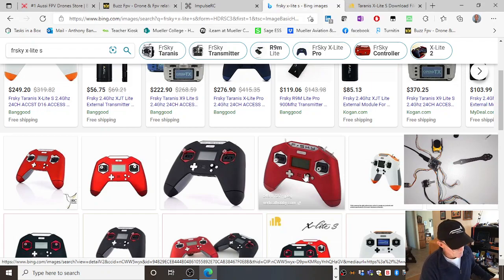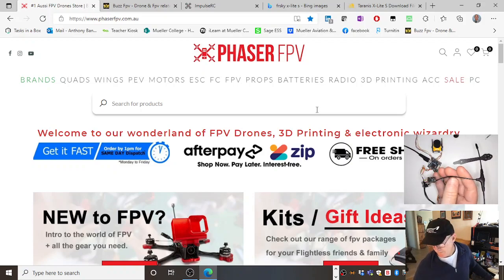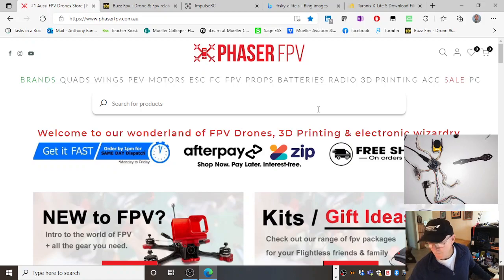So that's FrSky, but what you can do is, I did have a FrSky receiver on here, but I wanted to go to TBS Crossfire for the iNav part. Now TBS Crossfire allows telemetry back, so the receiver does transmit as well back to the transmitter that you're holding. But this is sort of long range, and it's a really solid link. I found this out when I had a FrSky receiver on, using a FrSky transmitter. I went to failsafe a couple of times when I went behind a little hill and other places. It lost radio signal, went to failsafe and just landed by itself.